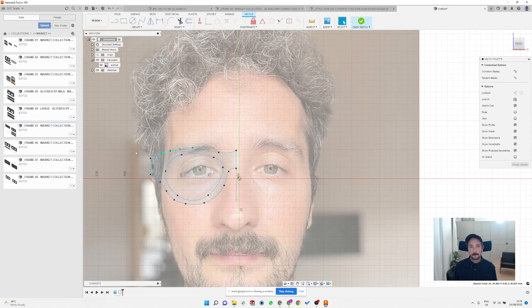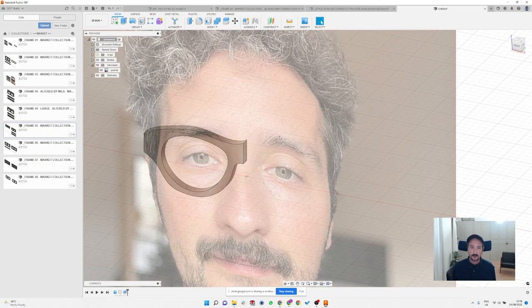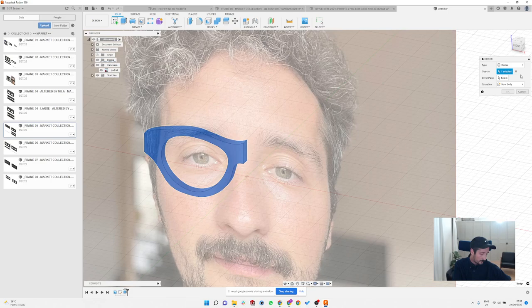You can see I've drawn a super rough sketch of a frame just to see how it looks in general. I'll take that part and do an extrusion of six millimeters — that's the thickness of your material — giving me the left side of the frame. Because I don't want to do both sides manually in the sketch, I'll just create this and mirror the whole thing.